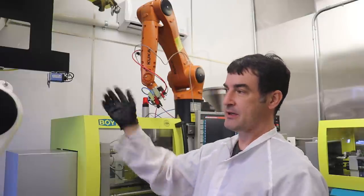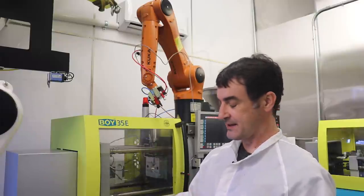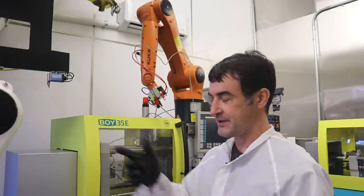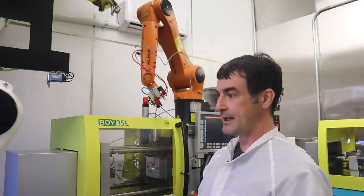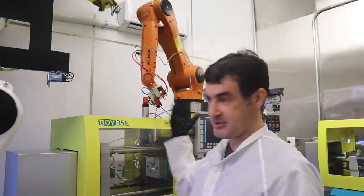And you can basically pass the baton between several robots using the 24-volt TTL logic, which is basically just a bunch of light switches on and off for different triggers for the different robots to do things. So it's pretty simple, but at the same time very powerful to get a lot of automation going. And any machine that takes or sends out 24-volt signals can talk to the rest of the machines in here,